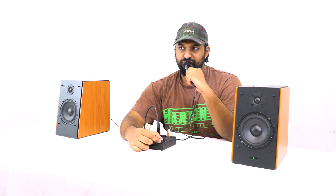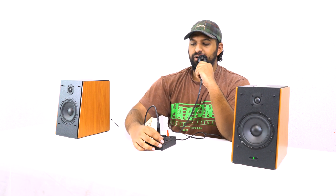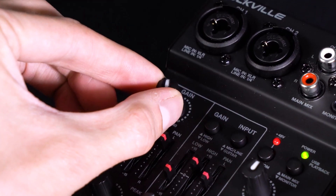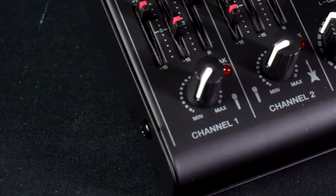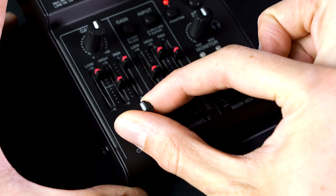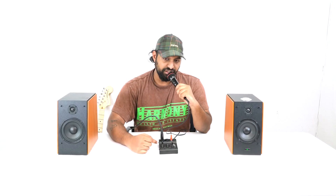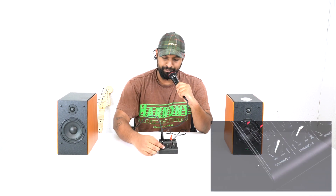If you want to use a microphone on channel 1, use a pure XLR to XLR cable. Go ahead and turn on the microphone and you can hear me coming through the speakers. On channel 1 there is a gain knob at the top to increase the level coming into the mixer, and a volume knob at the bottom to set the volume of channel 1 in the main mix — the gain knob controls input level, the volume knob controls the level going to the main mix.